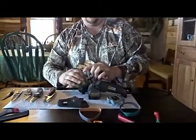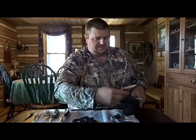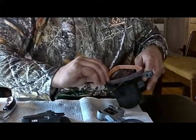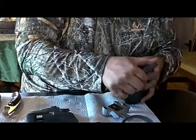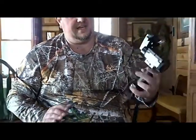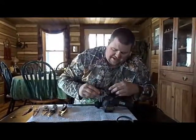It's real simple. The piece in the middle has a spring on it — you just push it down and your belt comes loose. Take the belt off, and then to put the new one on, simply slide it back into the grooves. There are two rollers in the bottom — it'll slide right in. Then push down on your spring and slide your belt over it, and that one's attached. I like to give the power switch a little flick to help line everything back up and get the belt even and straight.